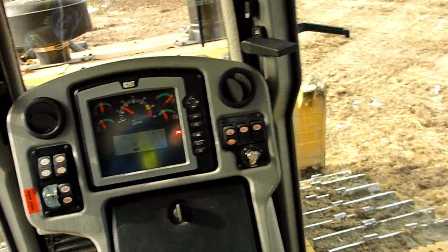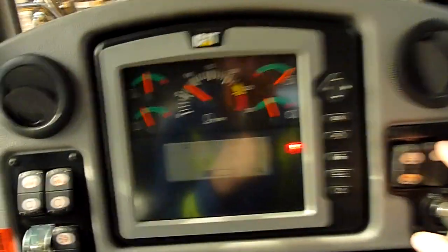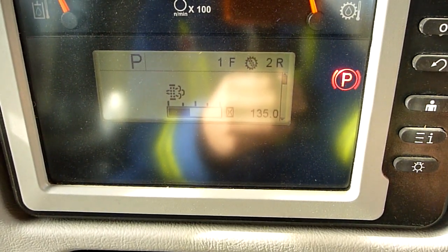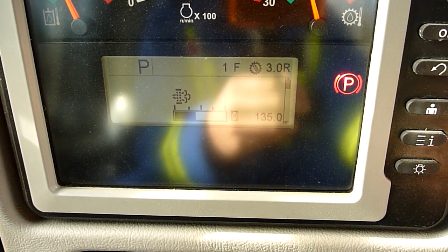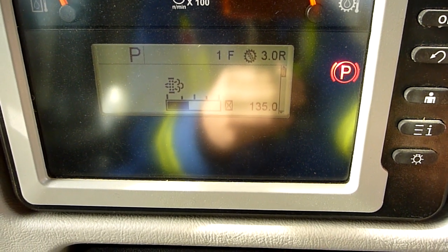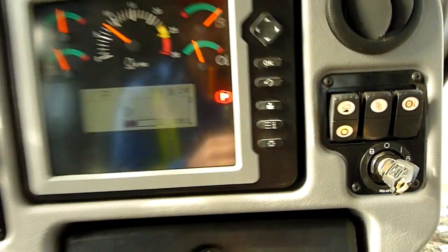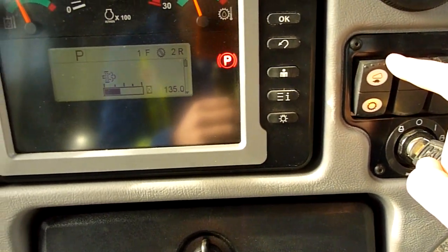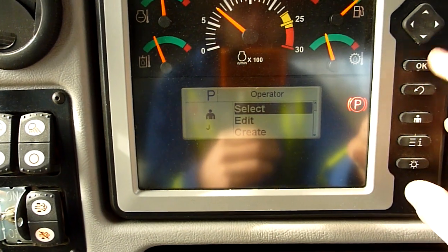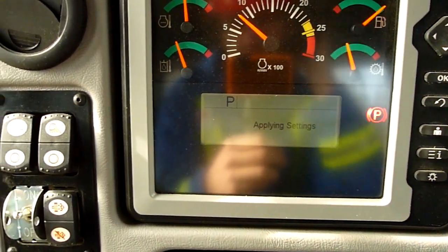That's a D6T. You can go auto downshift, or if you're pushing heavy it'll shift you down. This button here will change the shift mode every time you do a direction change — so when I shift forward it'll be in first, when I shift in reverse it'll be in third. I like to run in one and two. And this changes from a full shift to almost hydrostatic, like a John Deere. You can do operator profiles and save all your settings.